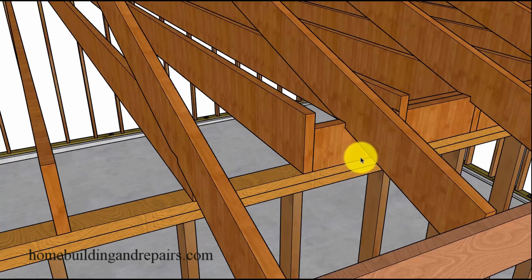Here's what I would do to support the roof rafters: you could do this in sections, supporting the ceiling joists and roof rafters by building temporary walls underneath them, or placing an individual 2x4 or 4x4 underneath each rafter. I think you could do it in sections — maybe two or three ceiling joists at a time.